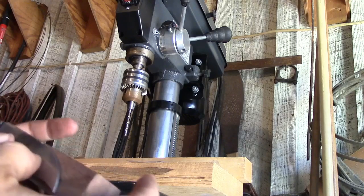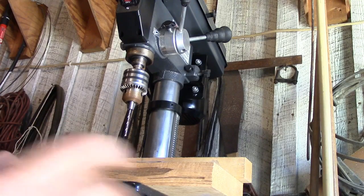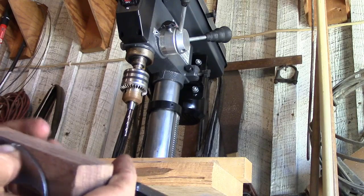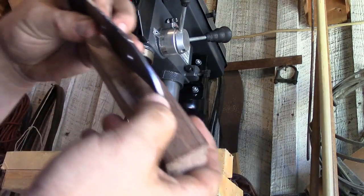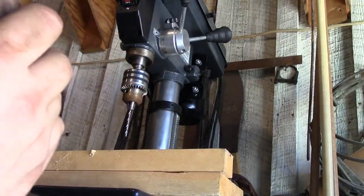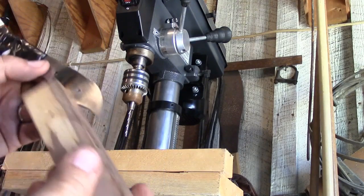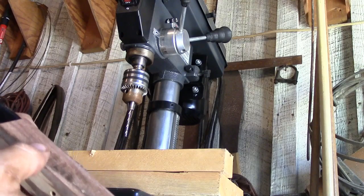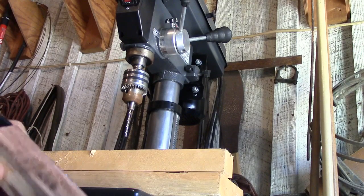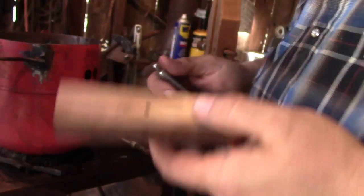My drill bit is just a shade bigger than it probably needs to be, so it may wiggle just a little bit, but when we drive those rivets together we'll actually be pushing them and they'll swell a little bit. We're also going to use epoxy on this — I did not include epoxy with the kit since you don't have to have it, but on all my knives I use epoxy. We need to split this block of wood, which we can do several ways. If you have good straight-grain walnut you can actually split it, but to be safer since you only have one piece, we can cut it with a hacksaw, handsaw, or bandsaw.